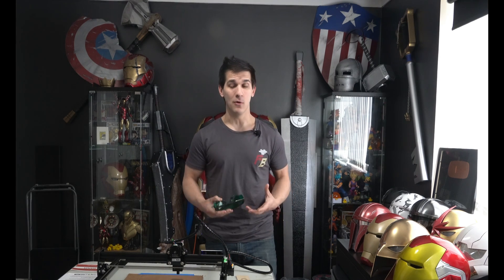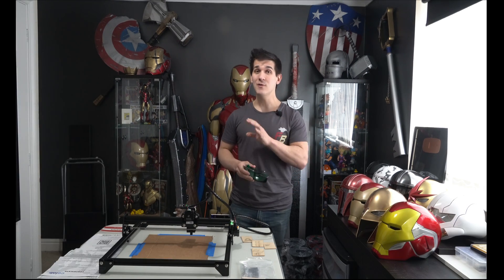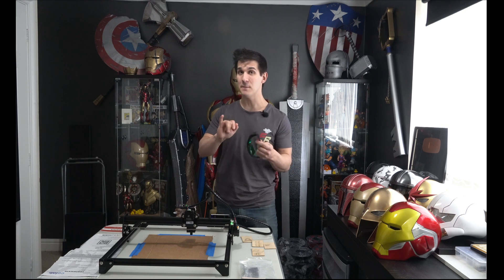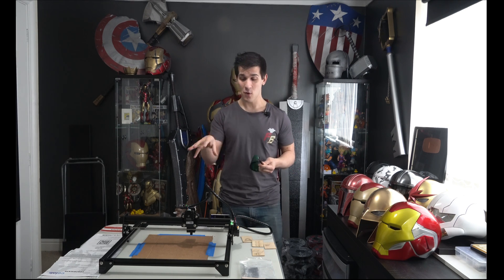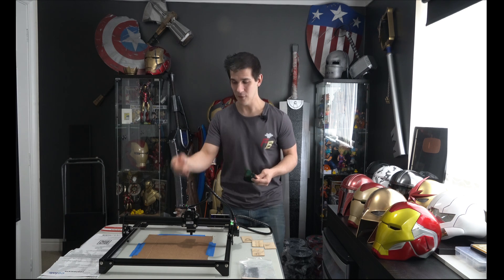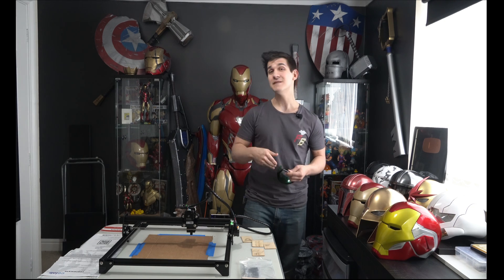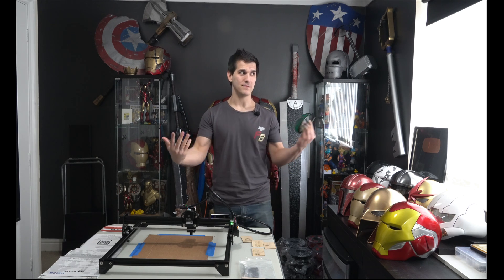You want to make sure you have proper eye protection because this can really do some damage. It's also cutting — it can cause smoke and fire. The best advice I saw online is: don't put your laser engraver on something you're not willing to burn or lose. I'm going to have it in the garage in an enclosure on a metal table. Never leave it running with nobody in the room. If a cut is going to take two hours, don't go get something to eat — stay attentive to it. This isn't like a 3D printer you can leave for days on end. As far as I know, this won't detect if a fire starts; there's no thermal runaway system that'll know if the bed catches fire — though maybe there is, and if I'm wrong, please leave a comment.